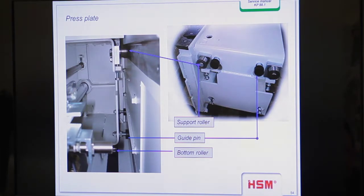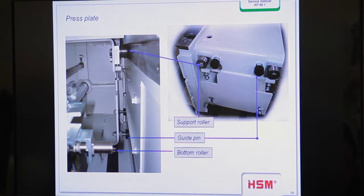When you crash the knives by 8 tons, totally crash the knife, you can imagine what happens then, yeah? Okay, and then we have also the guide pins on the side. The guide pins make sure that the press ram doesn't move left or right, yeah? So it's very important that the press ram is very fixed in the press channel. Every movement of the press ram goes also on the cylinder.